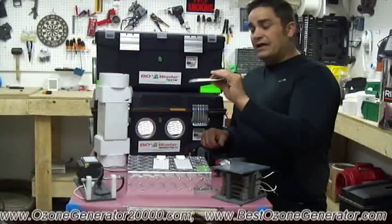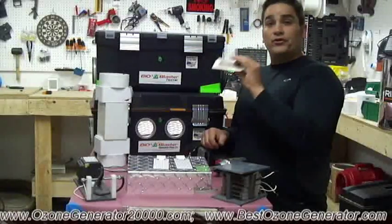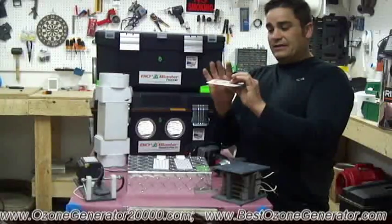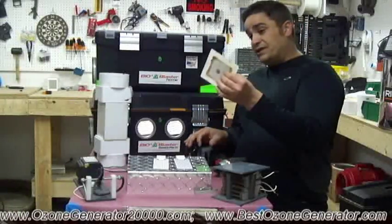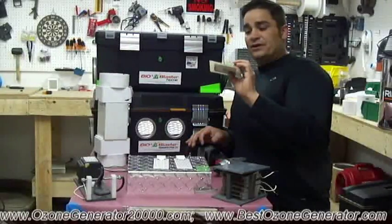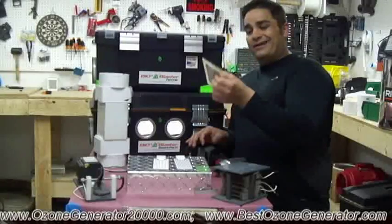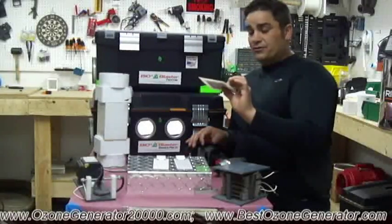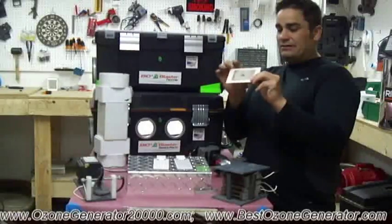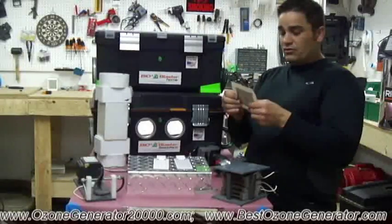Ceramic is an awesome dielectric because it will never burn through. This porcelain was fired at much hotter temperatures than this electrified metal will ever reach. And so it does have the design element of being a stable, non-burn-throughable dielectric media. The problem is, in this thickness it's rather flimsy, it's capable of being broken.